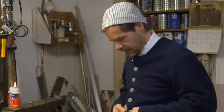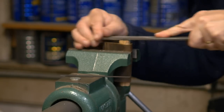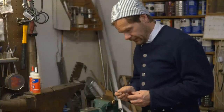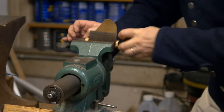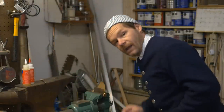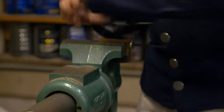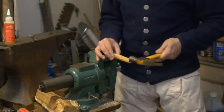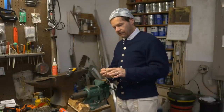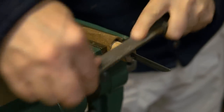If you've got a draw knife and a shaving horse, this would be very easy. Let's go ahead and make sure this is nice and perpendicular. We can use a little gimlet — this one's just the right size for this, another three-sixteenths inch tool. That'll make you appreciate an electric drill, let me tell you. I drilled it just a little undersize, and this should be able to take just a press fit. So we can use a hammer and we don't necessarily have to glue this one in.